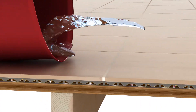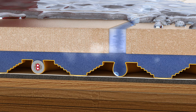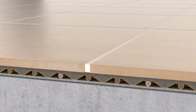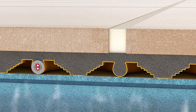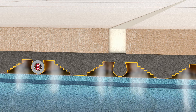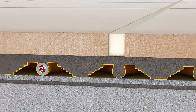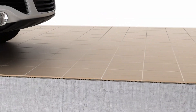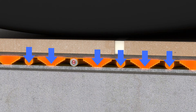Tile coverings are not waterproof — water can get through the tile covering to the substrate below. DitraHeat and DitraHeat Duo provide reliable waterproofing to protect moisture-sensitive substrates from water exposure. The free space on the underside of the membranes provides a route for excess moisture and vapor to escape from the substrate. This vapor management function allows for tile installation over concrete cured less than 28 days and concrete on grade passing vapor. Loads are transferred from the tile covering through column-like mortar structures formed in the membranes to the substrate below, ensuring tiles are properly supported when exposed to traffic.